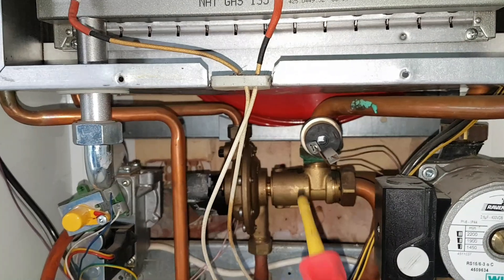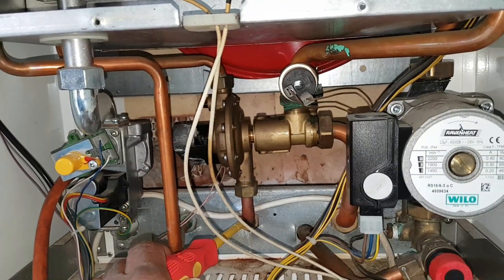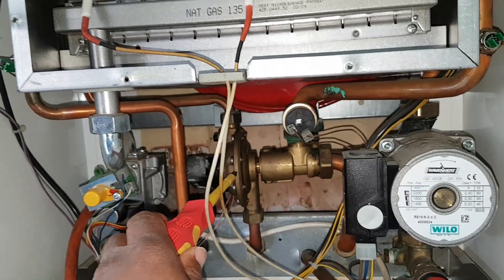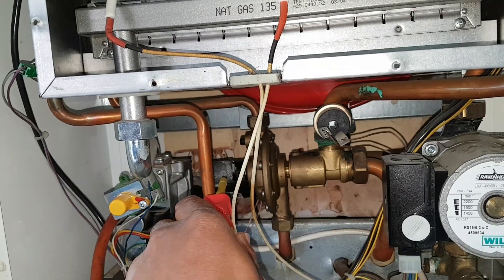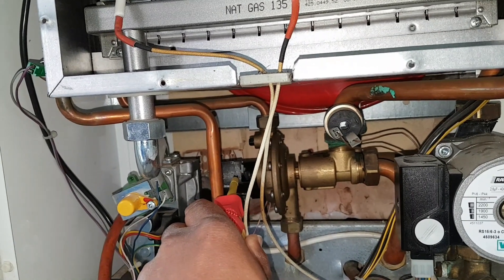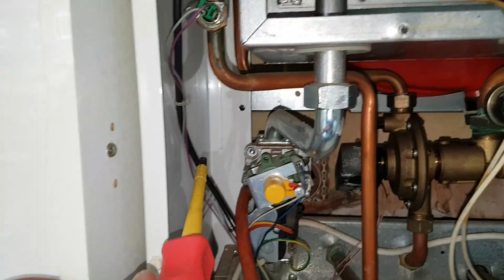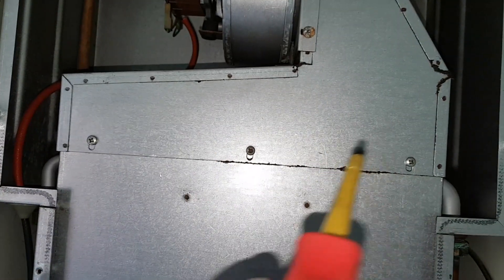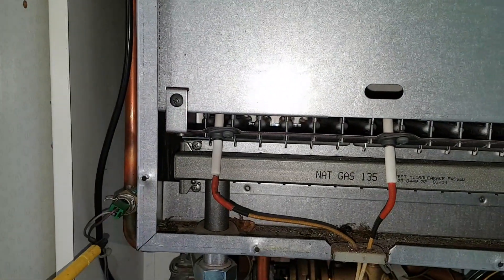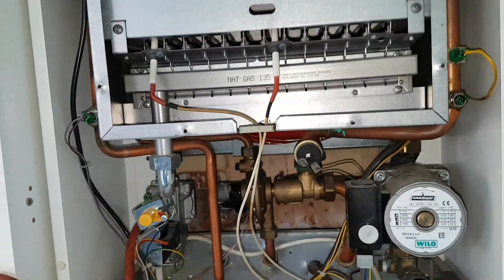You can see at the front here this brass part — that's a diverter valve. So in hot water mode, the cold water inlet here goes through the diverter valve. At the same time it pushes the diaphragm out, makes a micro switch here, and starts the process — so that's where the hot water process starts. It continues up and along into the back pipe, goes up to this heat exchanger, goes through the heat exchanger, and it comes out hot through the hot pipe here. That's a hot water sensor, and it goes to the taps that way.